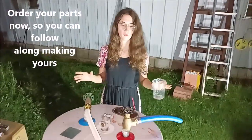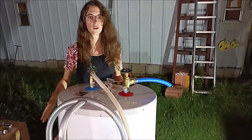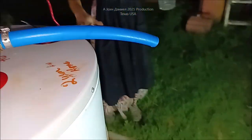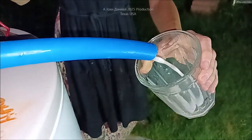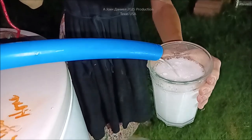All right, it's been about 45 minutes and we've got this ready to go. We are going to show you our results. We used this dolly to shake it, but you can do it yourself — or lay it down on the ground and roll it around as long as it's clean. CLR is usually safe as long as it's diluted and we're in a rural area. So this comes out the hot side — we're going to get a little bit coming out of there. Listen to that gnarly stuff going out. All of this madness was in your water heater.